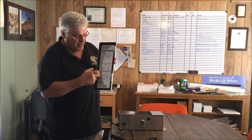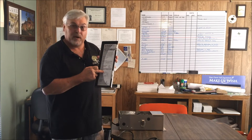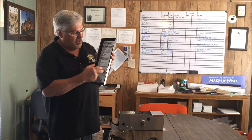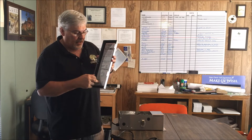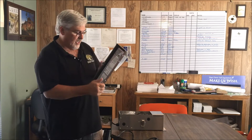Another thing I like is inside here it's got a place where you can write all your wiring information — run number, description of where it's going, voltage, amperage, and the voltage tap for that particular run. This keeps everything really handy. Just use a waterproof marker that's going to stick around.